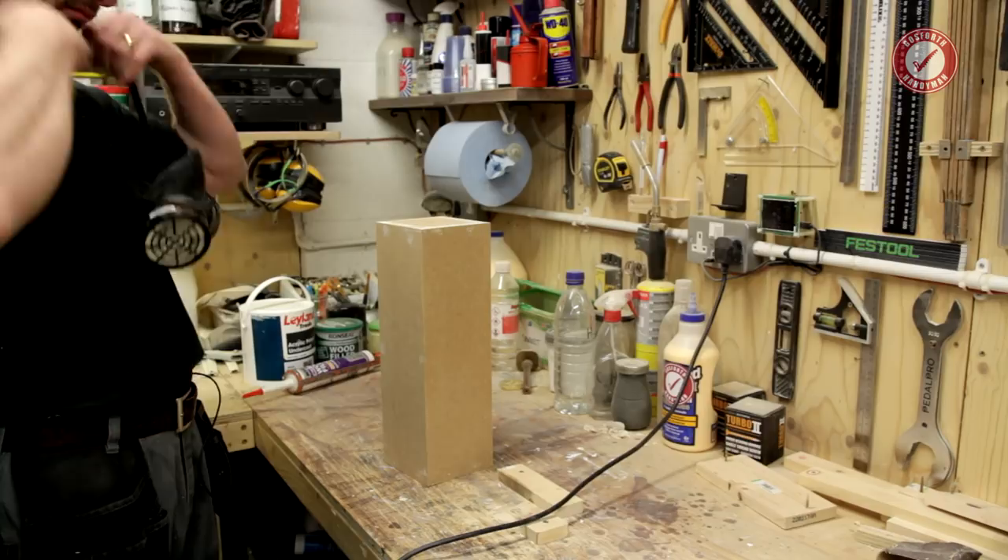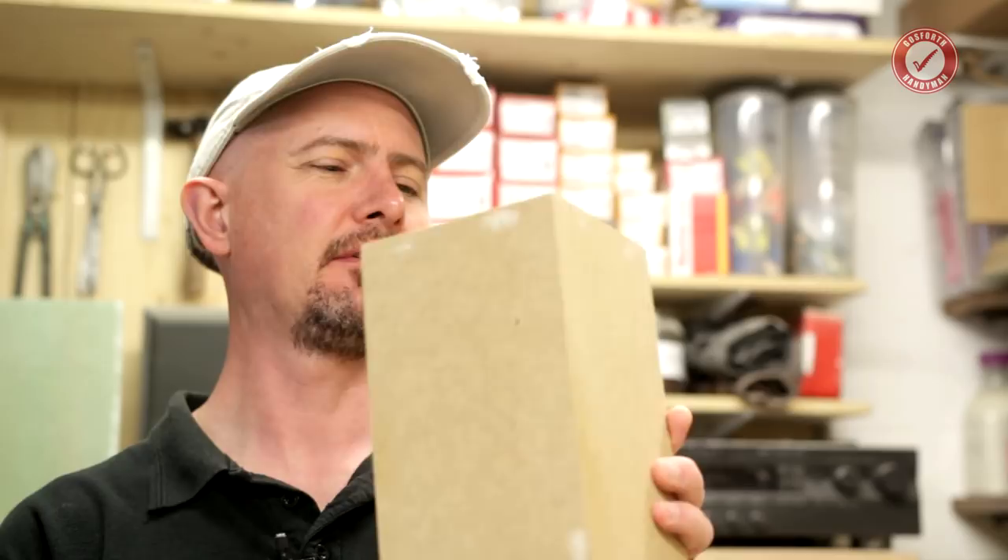That's it — all ready for finishing now, ready for final painting. I'll do the painting in a separate video; that'll be part three. I forgot to mention: I screwed some little stops onto my bench just to stop the piece from moving around while sanding. You can clamp something to your bench instead — it's not really practical to clamp the actual unit directly. An anti-slip mat doesn't work because it gets so covered in dust. Where I've got 50 or 60 of these to make, stuck blocks on the bench work much better.